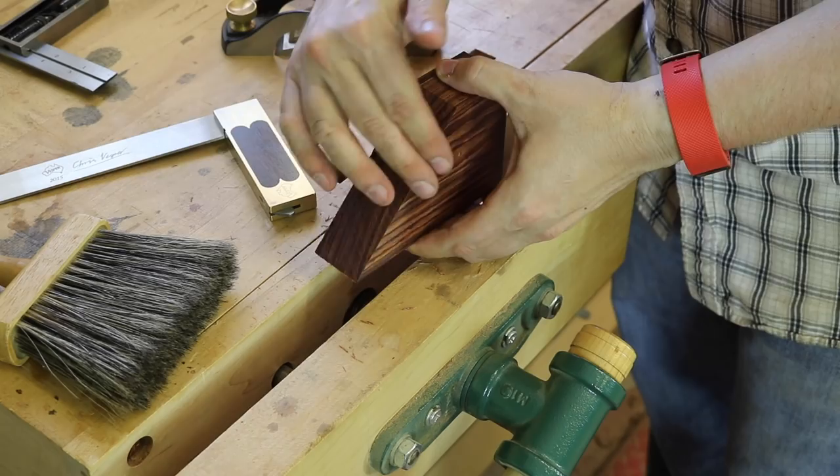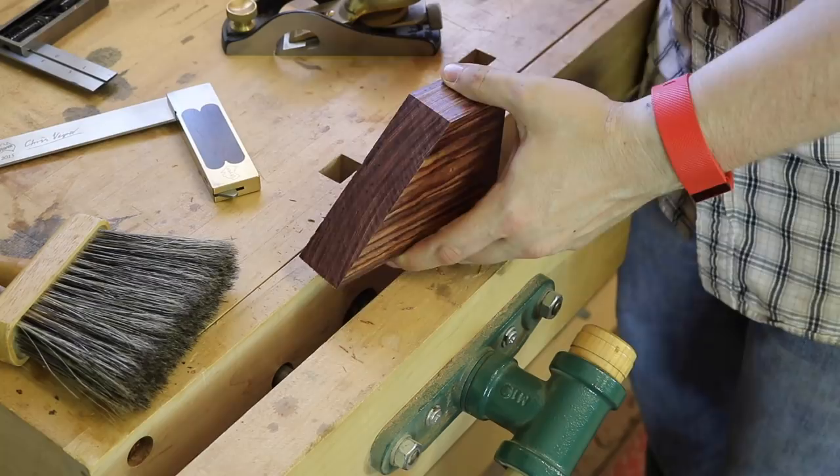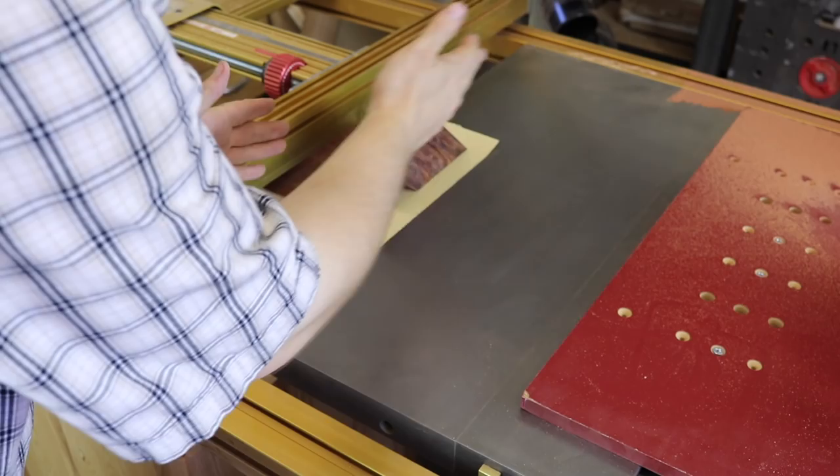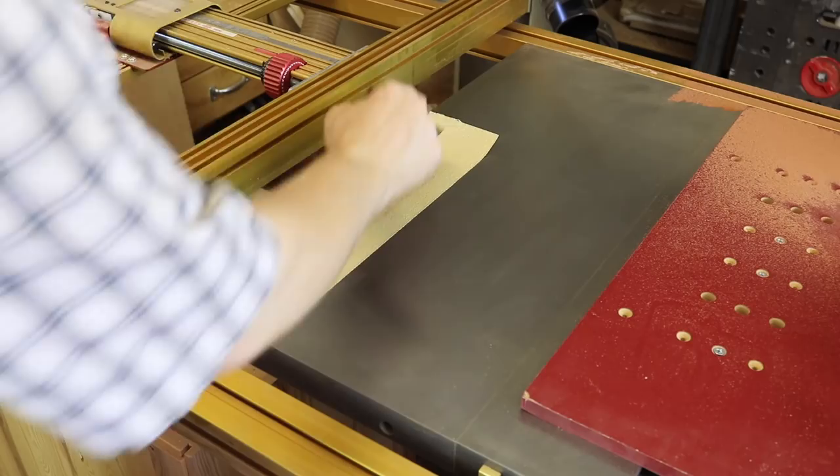From this face over and this face over. This side right here is just a tad lower than the rest. Take the block, put it on, apply even amounts of pressure — or if you need to flatten or bring one side lower than the other, you can apply more pressure to one. Just pull it back in one stroke, lift, and start again.